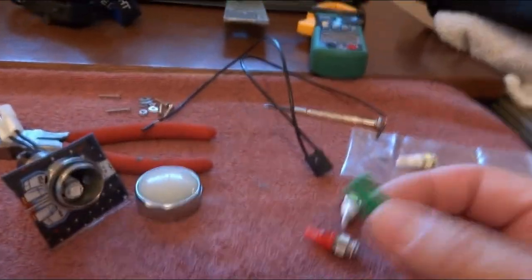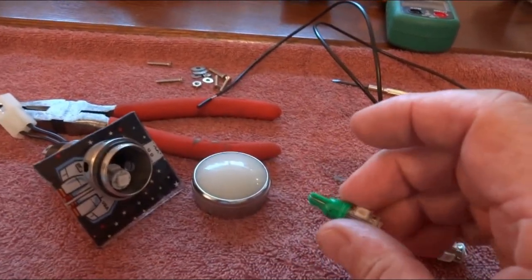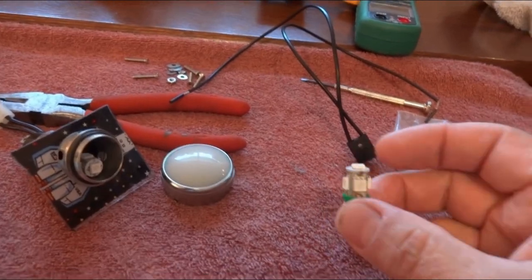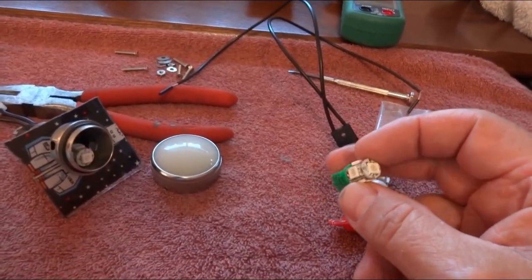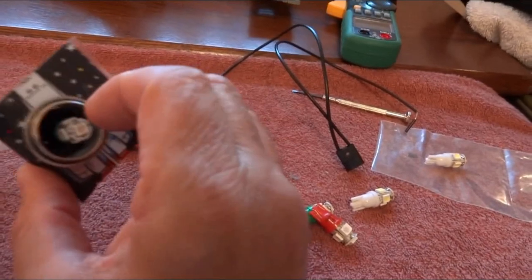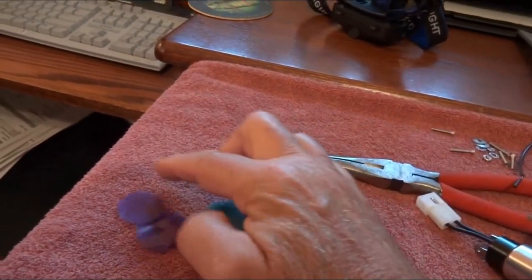These 555 Supers only come in 6.3 volts, so if you're supplying 12 volts to your dial lights, it's going to be too much — you'll have to knock that voltage down a bit. Cointaker does have some 12-volt LEDs, but they're not clustered like this; they're flat across the top. They may have some wedge ones, but I know they have bayonet styles. So if you need 12 volts and want LEDs, you can do the same basic thing — just make sure you get the wedge styles, or you'll need to work with a bayonet fit. And make sure you get the right colors.